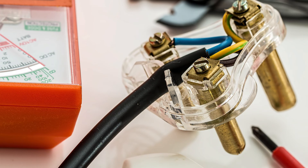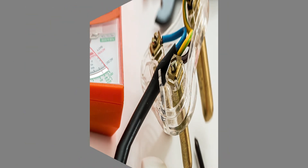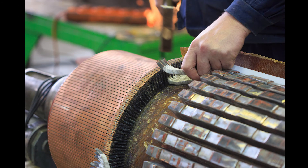324A is typically used for the encapsulation of electrical components, cable junctions and joins, or for filling voids around insulation. This epoxy is also sometimes used for levelling off surfaces or making castings.